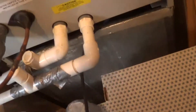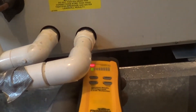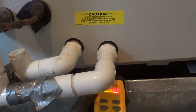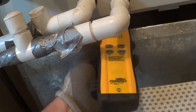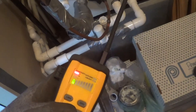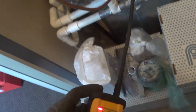We go back out here — notice we're not picking up the house. And then with the hot sensor now, I get a massive hit on the 410A refrigerant. See that? That's a consistent hit, three times in a row. That rules out squirrely behavior, because things will set it off that are not leaks. There's definitely an art and a science to using this.